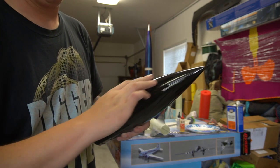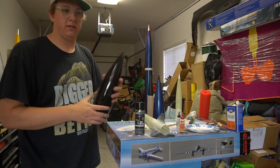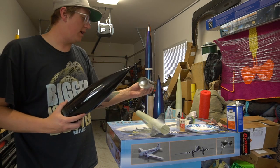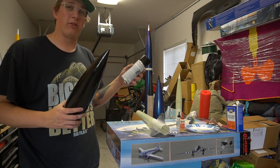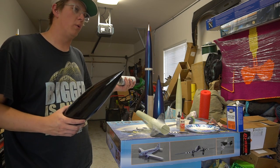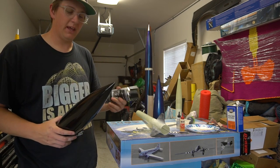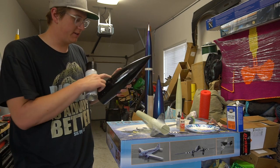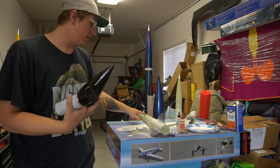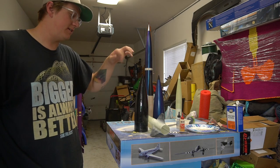I'd be fine leaving it as-is, but I'm going to wet sand just to see how it does. I also have clear coat to put on the airframe for the printed decals from Sticker Shock — he recommends clear coating over them. The spray pattern covers really easily and sticks to the primer and to itself well, so you don't get many run opportunities. The 3-minute flash-off is great: finish a coat, grab a sip of water, come back for another coat. It's sandable and fully cured in 12 hours, and you can cut, buff, and polish it. Being epoxy-based, it's pretty scratch and ding resistant — I dropped and bumped the rocket just before filming and the paint is still on there.